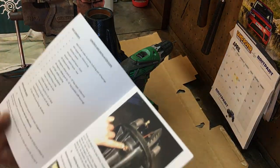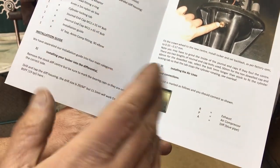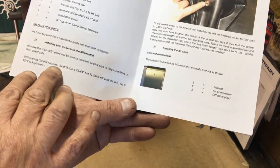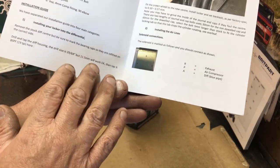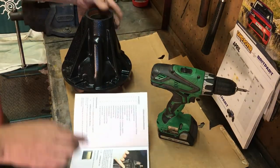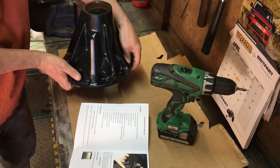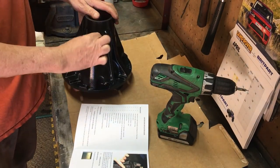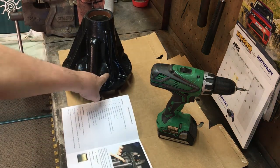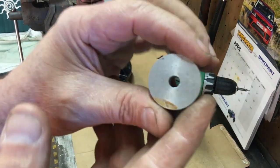Looking in the book, it's telling you first to remove the center, make sure the bearing caps refit on the correct side, then drill and tap the diff housing. The drill size is 29/64, but 11.5mm will work. They're telling you to drill it next to the bowl where the oil feed is for the bearings. So we've got the flat on the bottom here - turn that over facing away from you - and you're going to drill it roughly there.